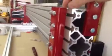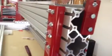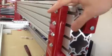I chose a side first. I temp installed it and realized I was going to need to make some adjustments. With the carriage clamped up against here, I put the extrusion on, got everything sitting flush and flat, leveled the distance between here and here on both sides, and then locked this side down completely. Then when I temp installed the other one and snugged everything about a turn of torque, I noticed on my rail it was off about that much — and what that told me was that this beam was bowing that way.